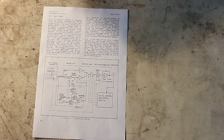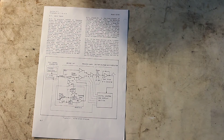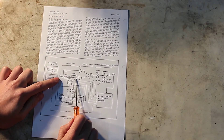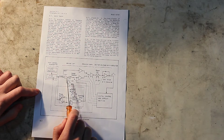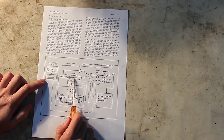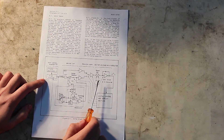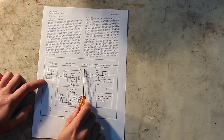Before taking any measurements, let's take a quick overview of the simplified block diagram. In order to measure an unknown impedance, the instrument applies a voltage of a certain frequency to a branch which consists of the unknown impedance and a shunt resistor. Then it measures the phasor voltage at both components, and finally the unknown impedance is simply the ratio of both measurements.